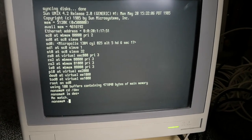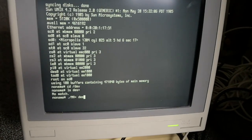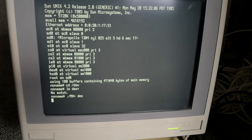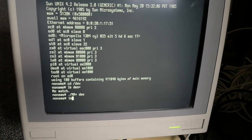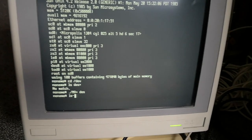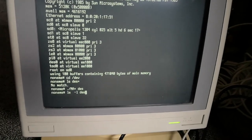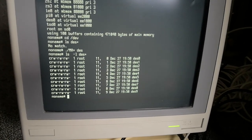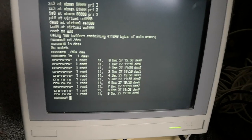So let's go and check, because there is no DES stuff here. And we need the make dev program to make a DES chip entry here in the devices directory. A bit awkward typing with one hand, so forgive the typos. Yeah, we got a DES device. Actually, we got 10 of them. I don't know why you would want to have 10 chips in your device.